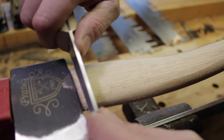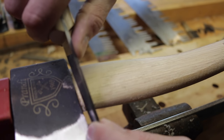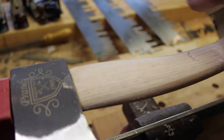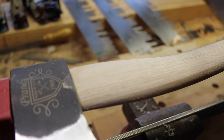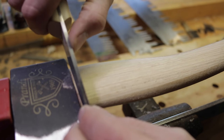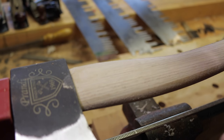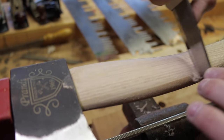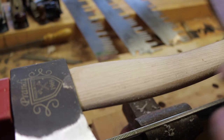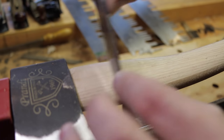But if we take a really sharp knife we can pull those out. I guess what I'd say is: why mess with the four-in-hand at all, because you'd have to go back and get this nice finish on your axe when you could just start with a good knife. You get that gleam - that beautiful finish where the wood has been cut with a blade, severing those cells cleanly and sharply, versus kind of bending them over and mashing them together with sandpaper or the coarse filing teeth. This is a much more enjoyable procedure.